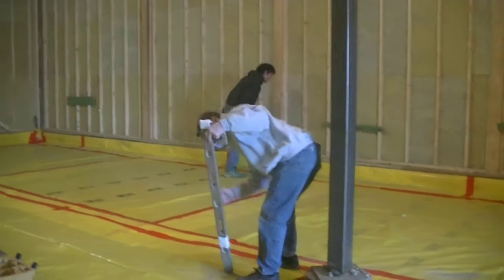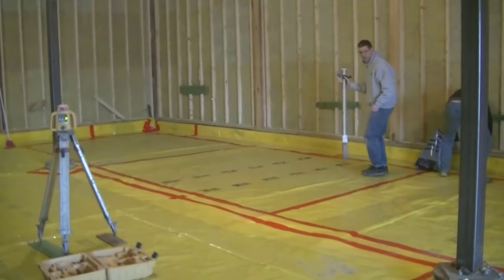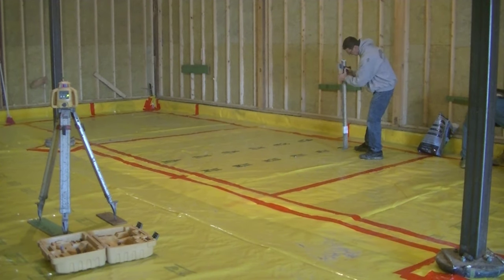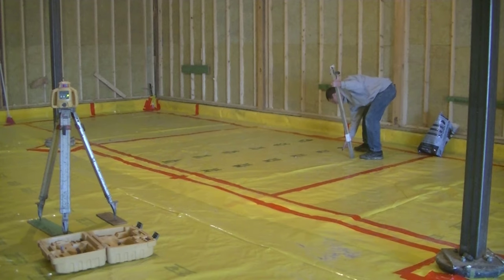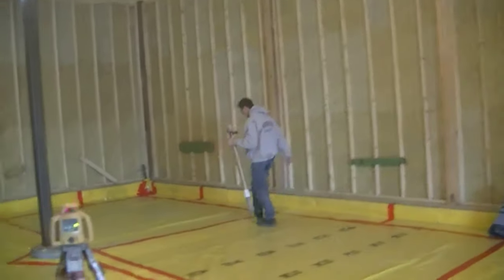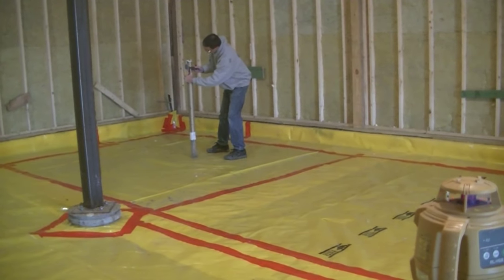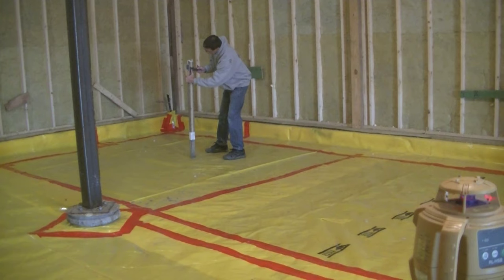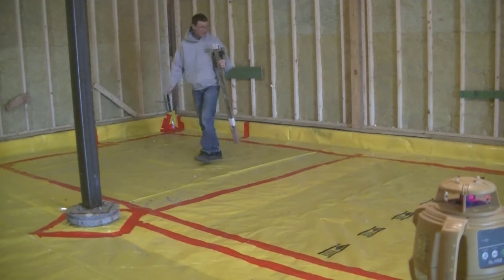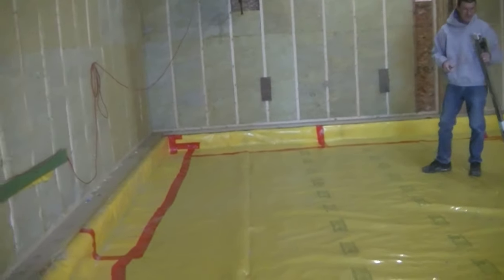That one spot ended up being five and a half inches. Now I'll do the same thing over here. Remember, 28 on that grade stick was the top of the concrete floor. I'm moving it to wherever I need to figure out the sub-base — it could be 33, it could be 33 and a half. It's supposed to be 32 for four inches thick, since the difference between 28 and 32 is four inches. But I've got a lot of 33s, 33 and a halves, and one 34, making it six inches in that spot.